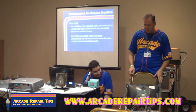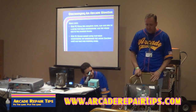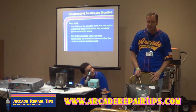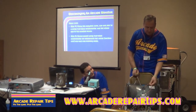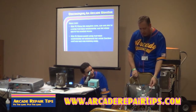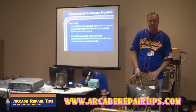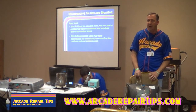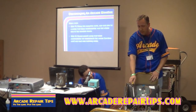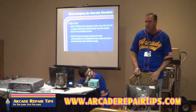But you know, this looks like a TV, and here's our chassis and our neck board. This thing right here, this is where you'll see a lot of times high voltage. You notice what this is called? Anode. Right, this is the anode, okay? Now, the high voltage comes from the flyback, and it comes around and goes into your tube.